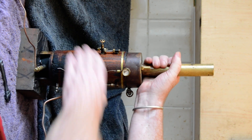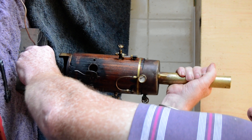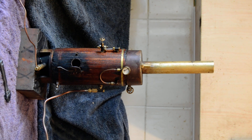There's a little bit of a crack on the pressure gauge but it does work — you can see it's at zero now. We'll run it up to about 60 pounds and I'll try and show you how much steam comes out at 60 pounds; it's quite a lot, I'll have to move the camera away. We'll see how long it takes to go from a cold start to getting the gauge off the bottom, then up to about 60 pounds. I'm using a little ceramic burner, about two inches diameter — quite an efficient little thing. The clock second hand is just coming up to the top now so we'll give it a go.